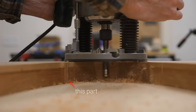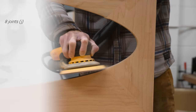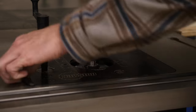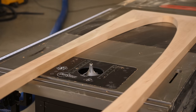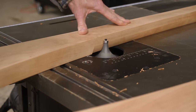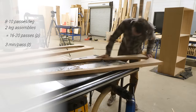From there I could flip the piece, change to a flush trim bit, and do one final pass on both legs — maybe another five minutes. I leave the joint transitions rough and sand those smooth to prevent chip out from the router bit: orbital sanding then by hand at each joint, eight times total, probably around seven minutes. After that, I wanted to add a large round over on the inside curves using a gigantic round over bit. A bit this large needs to be used with care, so very light passes working up to almost full depth — raising the bit a sixteenth to an eighth of an inch per pass, with an inch and a half radius. Probably eight to ten passes per leg, 16 to 20 total, at around three minutes per pass, so at least an hour.